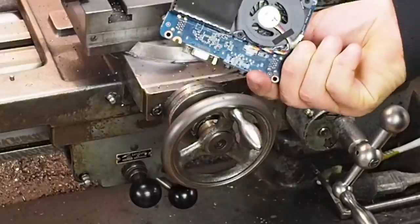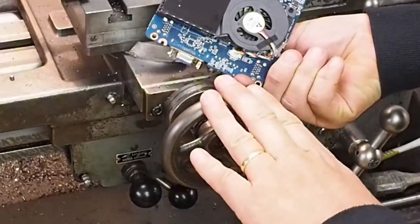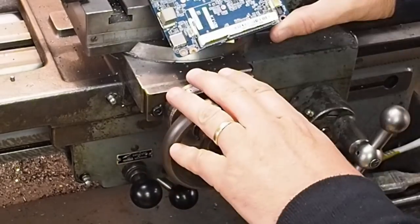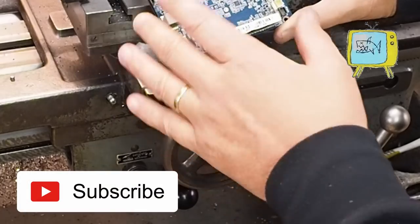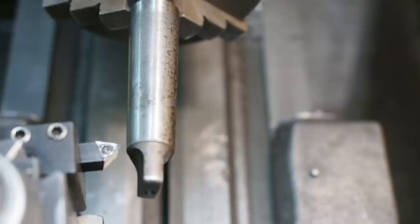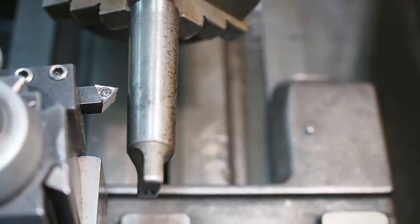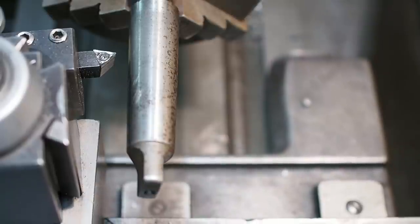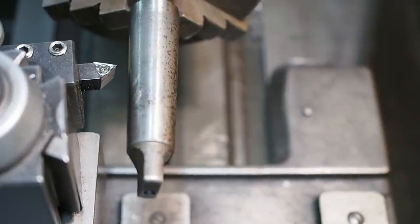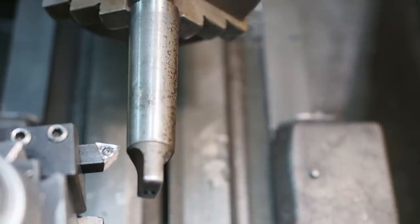So part of the task of setting up a computer for a CNC is to make sure that motion control gets the highest priority. And that's called real-time operation. We don't want it stopping in the middle of a cut to renew its subscription to Rotary SMP's YouTube channel, for example, or to ask you to install a new driver. As you can see, any jerkiness would of course be a blemish on the part. So assuming we've got our computer running with a real-time operating system so that it doesn't stop to look at its navel, we should be able to get nice and clean and constant motion commands from the computer.